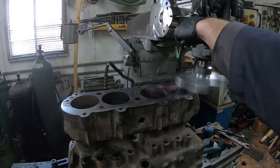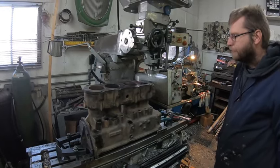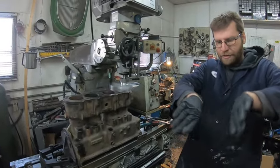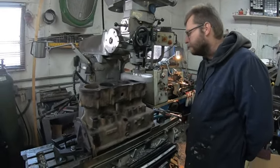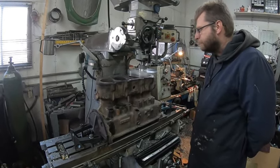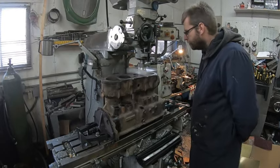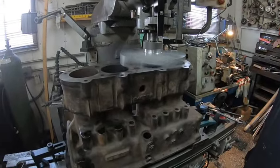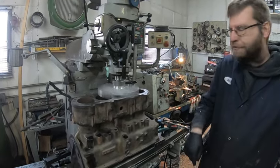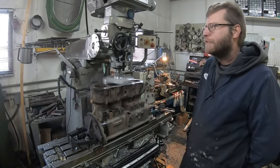You can see it's touching on the back side there now, touching over there now. It's almost like the block - the weld might have pulled a little bit. It's cleaned up here and cleaned up here - like I said it's sitting like a U. I think I'm probably going to kick the head over. Now there's not touching on the back side like that.